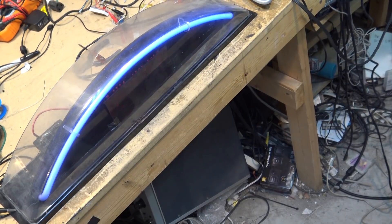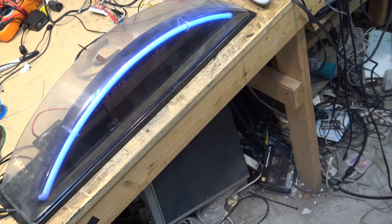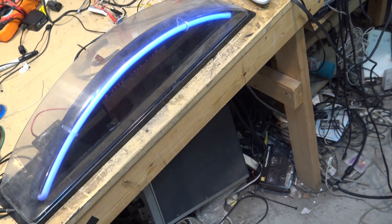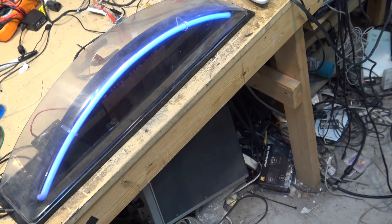What I have here is one of the first neon clocks that I built many, many years ago. This is just a piece of neon tubing — it's supposed to glow bright blue. It's glowing very, very dim because the inverter has failed again. This is one I've repaired before. It uses 12 volts stepped up to probably 1500 volts or so. This is typically a cold cathode fluorescent — not a full-on neon tube, because neon tubes are always red, filled with neon gas, and need a much higher voltage to ignite. Cold cathode fluorescents typically operate at 1000 to 1500 volts, and the inverter has gone bad. So I'm going to show you how to fix one of these little inverters.